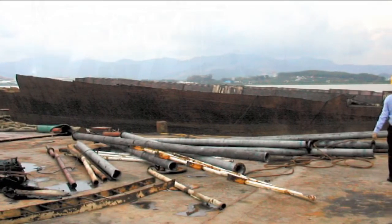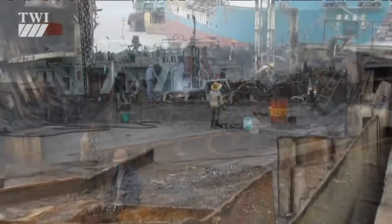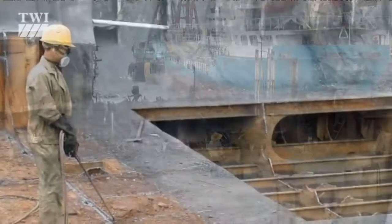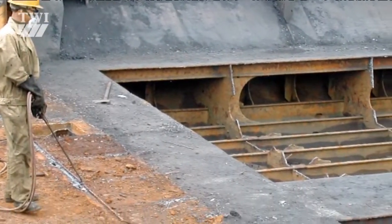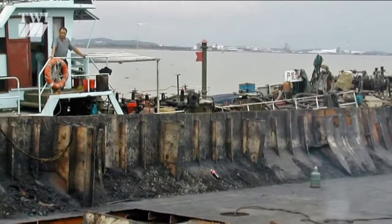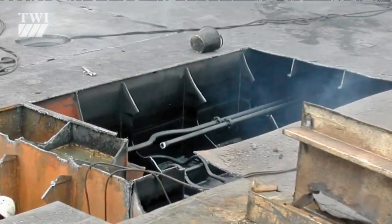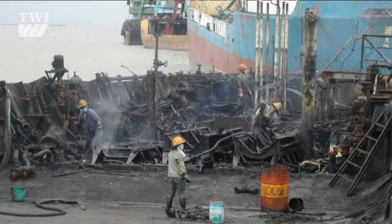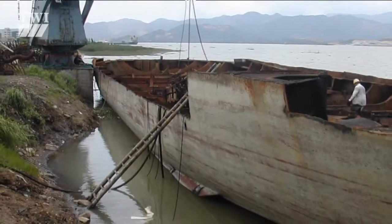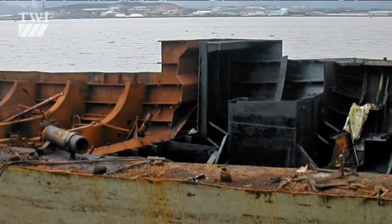The second technique is alongside, where you bring a ship to a quayside in a normal port facility. You start cutting it up in horizontal slices, removing first the superstructure and working your way down, leaving a small sole — usually about ten feet above the water — forming a thin layer that you can then drag onto shore or lift. This technique is used in North America, in the United States, in Brownsville, Texas, where there are a few yards using it.